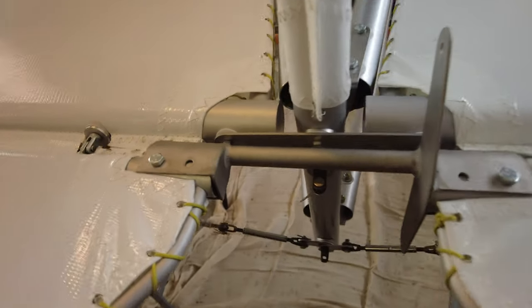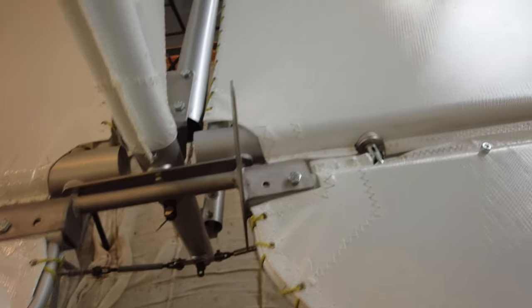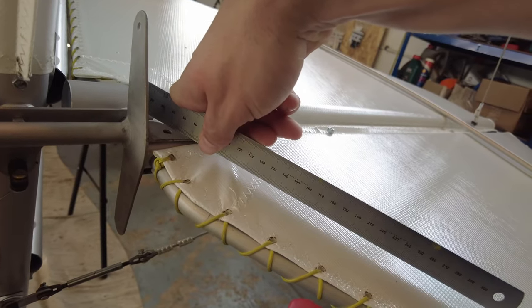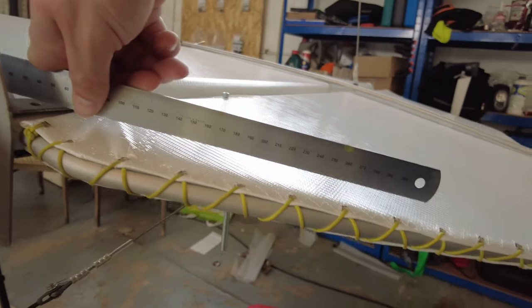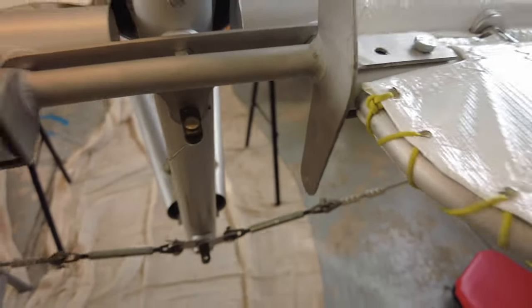It was all about making sure this was absolutely right. It's been difficult making sure this bracket here is at the right angle — the same angle as the elevator — so you get the same on the underside as well. And under here should be 90 degrees to the elevator, which it just about is. You've got to do this by a combination of sight and creating your own method of doing it.